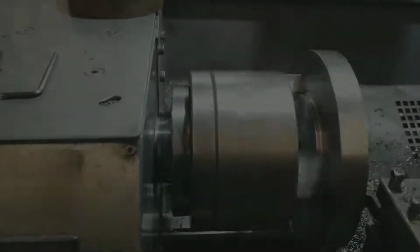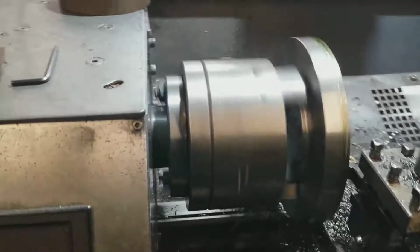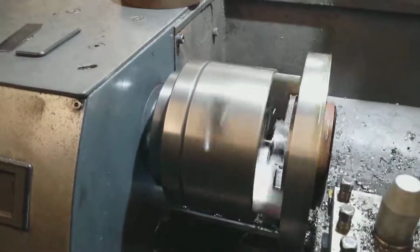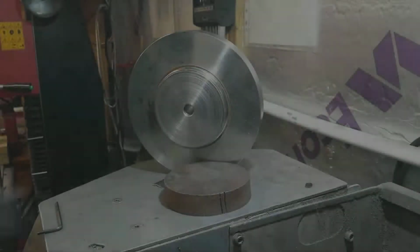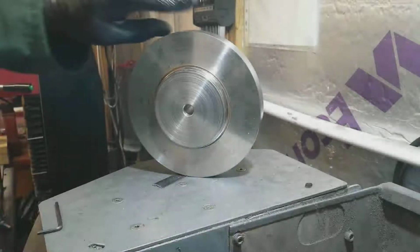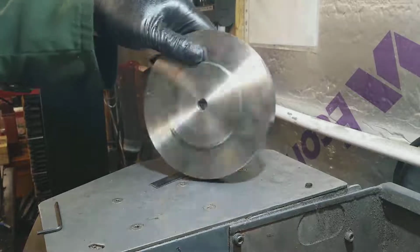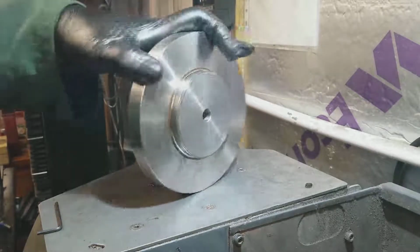And here you can see how the 3-jaw chuck handles the spigots on each side of the flywheel body quite nicely. So that done, the plan was then to mount the smaller piece of steel onto that, and that we will call the hub, for the sake of simplicity.